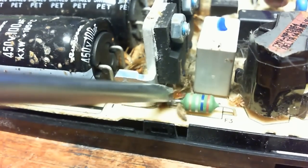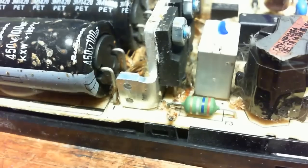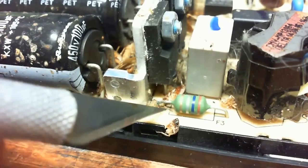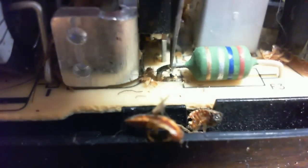You see the arcing from smacking roaches has actually caused some of the plastic coating to burn off that's usually sprayed on these. See how it's greenish? That greenish right there — this didn't burn all the way through, but that greenish is caused from an arc burning up a roach. It's actually corrosion. And if you look at the bottom side of that heat sink, you'll see another little bit of green on it — that's where the arc reached the other side.